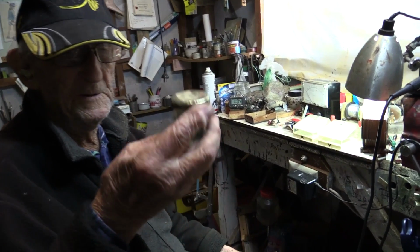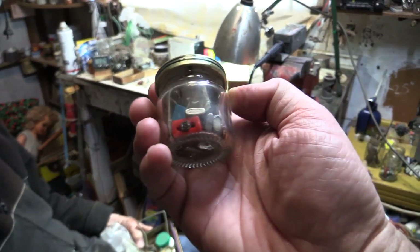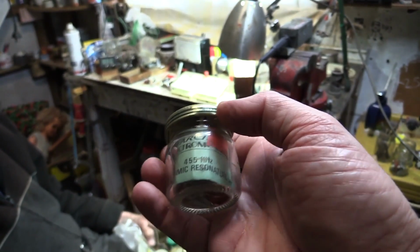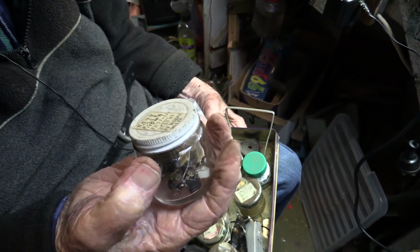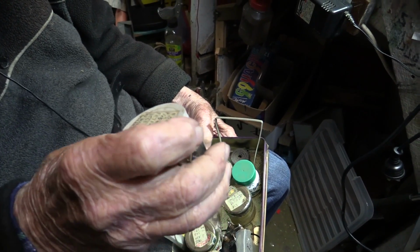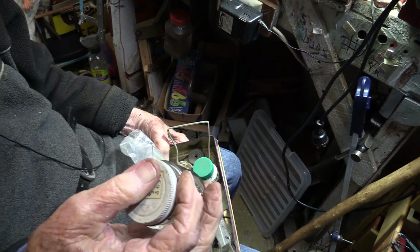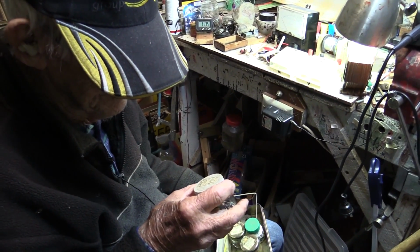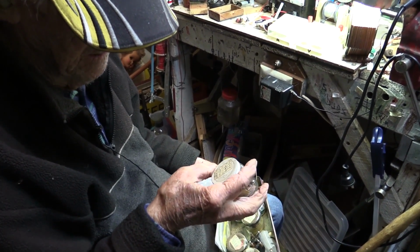Oh, there's the ceramic filters. You won't see those in use now because they used those for sidebands on the old sideband radios. Yep. FETs. You've got some FETs in there as well. I got a 548, that's right. Yep. 548, 547, 549, they're all the same, the three of them. And I got a couple of FETs.